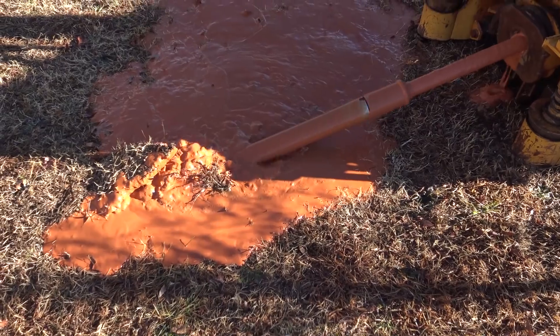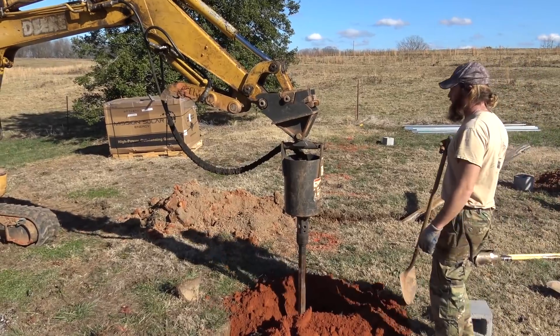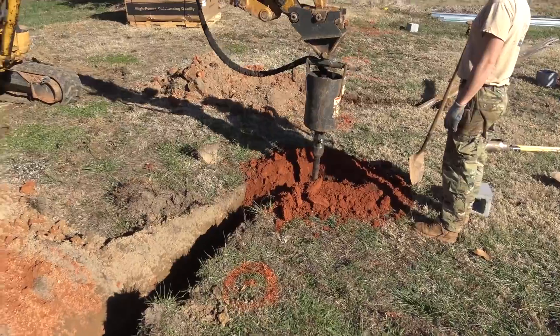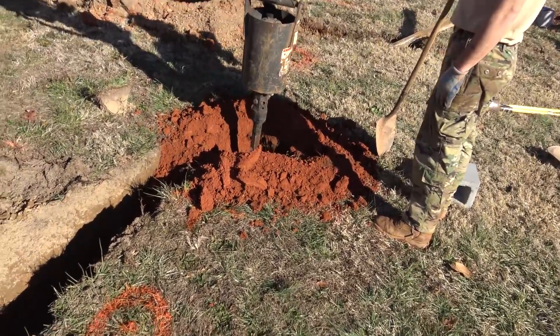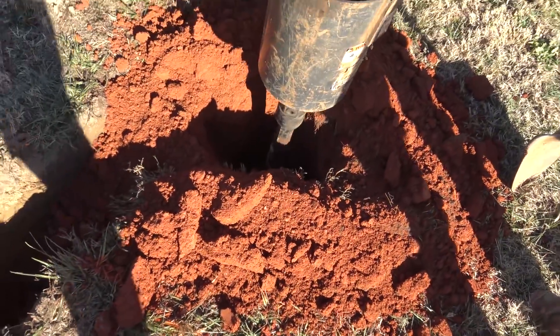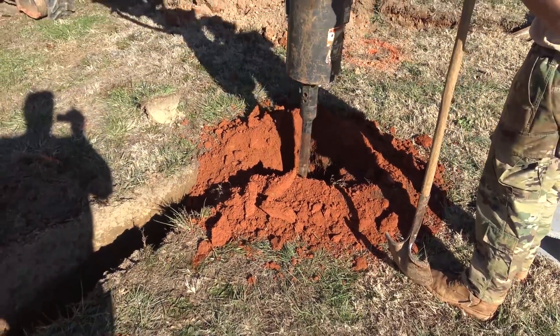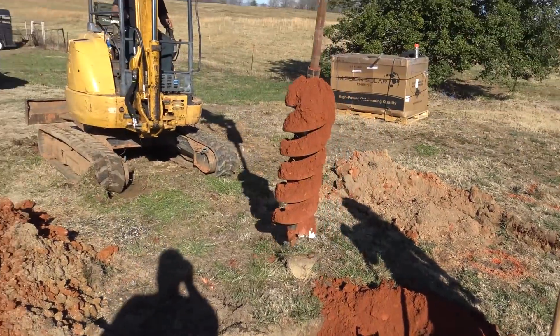It's lunchtime and we're starting to drill our holes for the solar mount. I like to take a 12-inch bit and pilot that hole first, even though the two-footer will go in — it just goes so much nicer. It doesn't take much time to change out the auger.